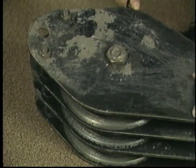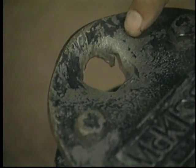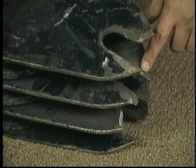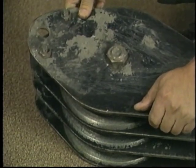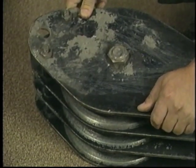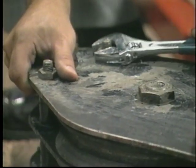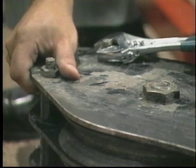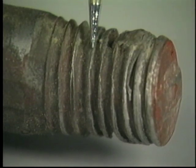The side plate of any block is an important point of inspection. If a side plate is bent or curved from its original shape, or holes in the side plate are elongated or stretched, the block should be taken out of service. There should be no play or looseness of a side plate. If a side plate is loose, this is likely a sign that the nuts and/or bolts used to hold the side plate to the block have loosened or are missing.